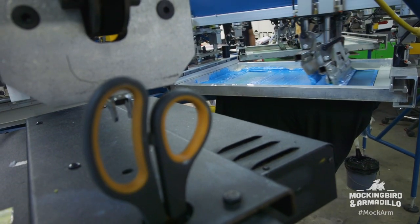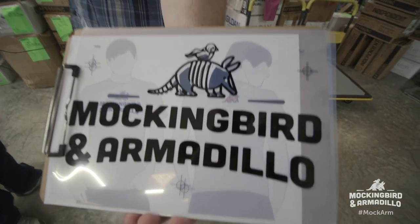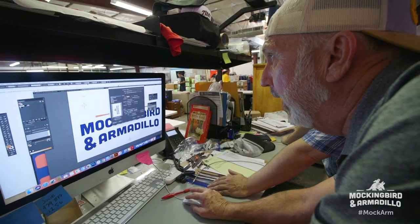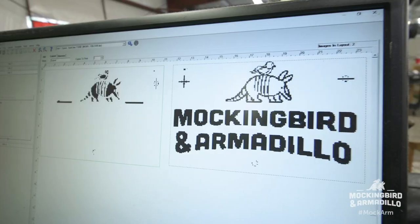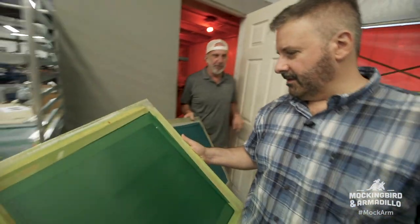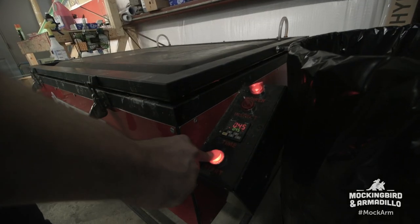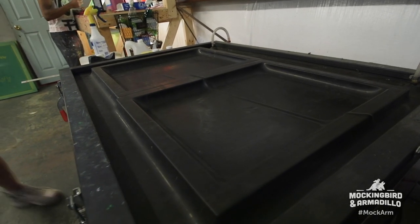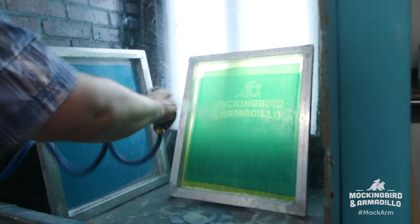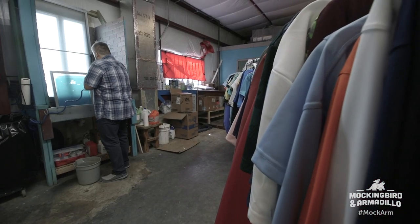Is it hard to do? Is it hard to do right? With some support, it'll be easy. Let's try something — let's do it. We're gonna get the film of your artwork. Each color will have a separate film, because we have to make a separate screen for each ink color. We're gonna get a blank screen coated with a photographic emulsion. Used to be silk — that's why they call it silk screening — but now it's a polyester fiber. We're gonna expose your screen to an LED light source. Where the light hits the screen, it will harden it, and where the light does not hit it — where your artwork is — that will wash out with water. Essentially we'll be making a stencil.